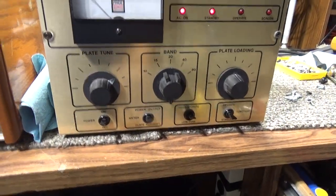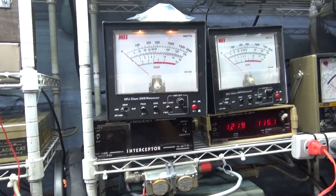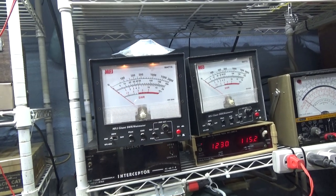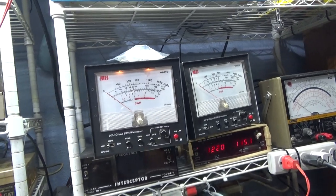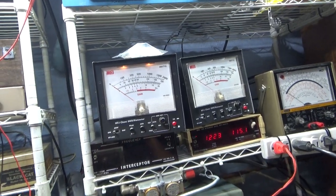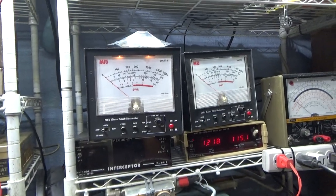A lot of amplifiers like that, as opposed to high dead key and low swing. So anyway, that's on standby, and just a radio on a dummy load on the 20-watt scale on average — about two and a half watts, swinging about six or so. If I retune the radio you'd probably get four to four and a half, but I've got all this junk in line so it needs to be retuned.